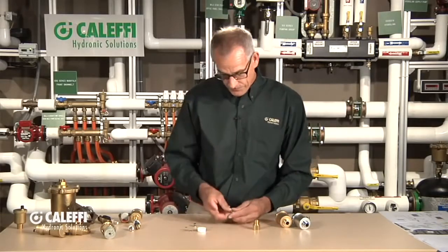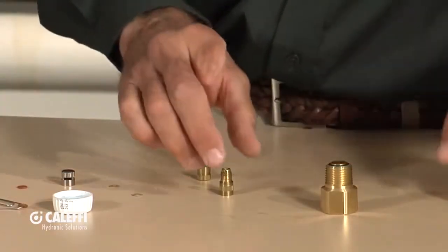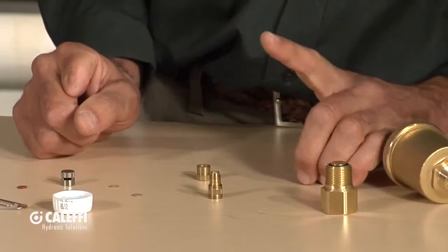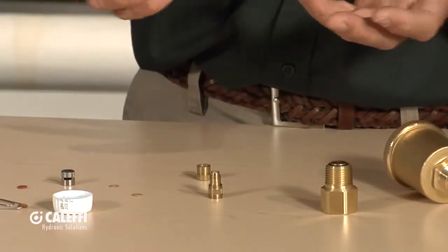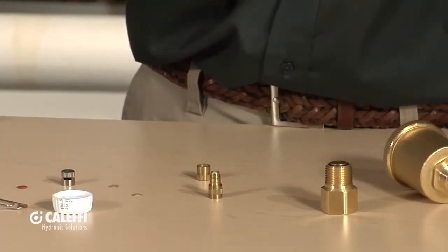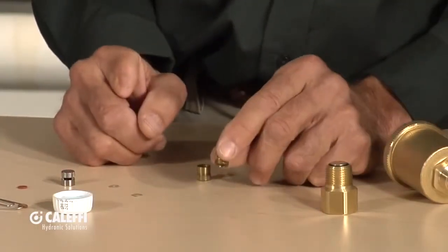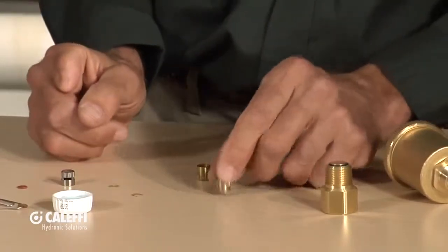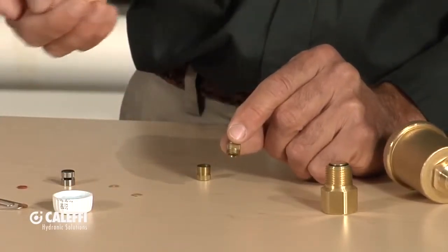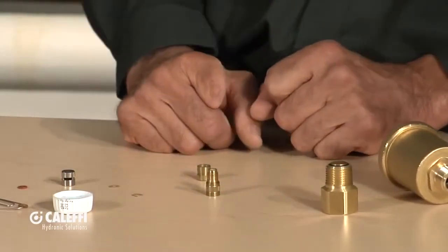Here's another great little problem-solver accessory. That little part is a check valve cap that fits on the same thread on top of any of our vents. What it does is let air come out but not let air go in. On systems that are misplumbed — for example, where a high-head pump and the expansion tank relationship is wrong — you can actually suck air into an air vent the same way air expels out. This cap lets the air come out, but if that high-head pump starts and puts negative pressure on the cap, it won't let air go back in. The right solution is to go back and fix the root problem, but this is a nice problem-solver if a customer says you purge the air and weeks later the problem is back. Keep one of these on your truck — put it on, the problem goes away, and you know what the issue is. That covers the product range of the automatic air vents. We'll get into the central air separation devices and their features and benefits in the next video.